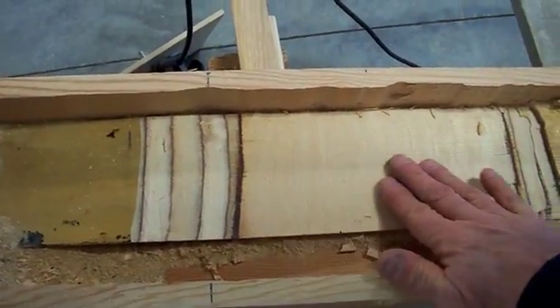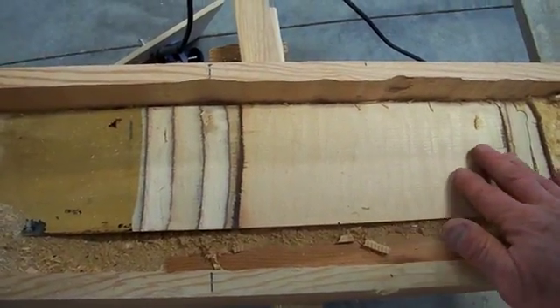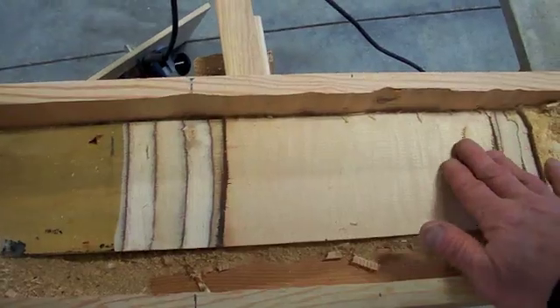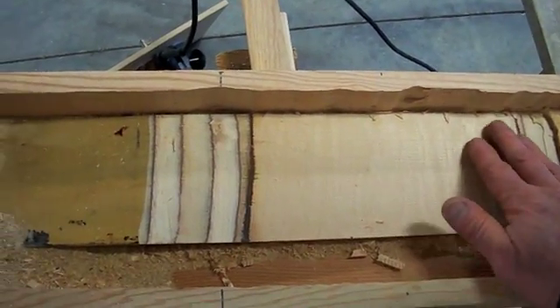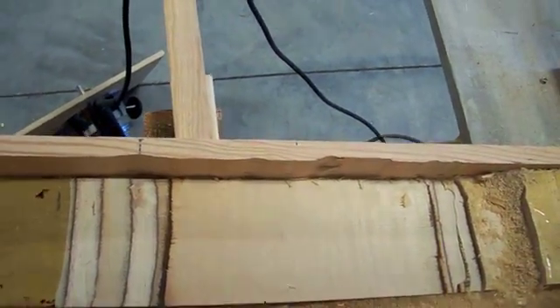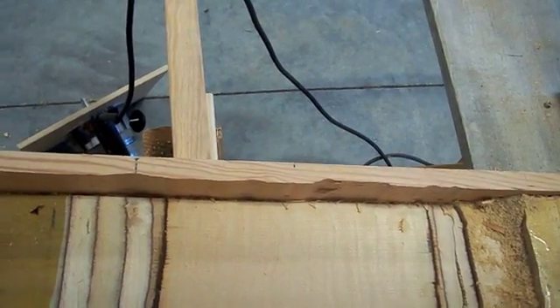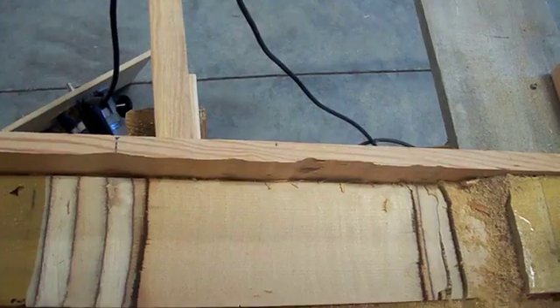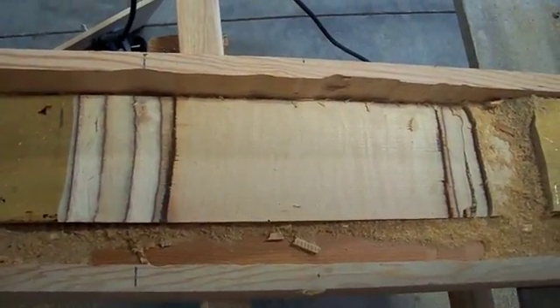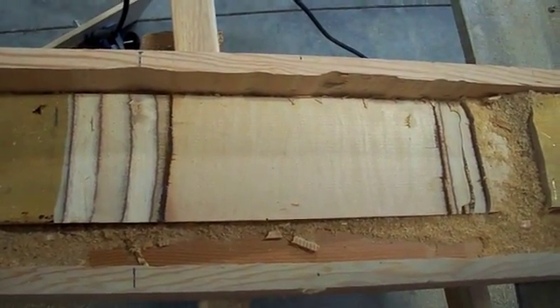It's pretty smooth. It's nice to cut with a mill end on the router because it opens up the pores in the wood and helps the glue to stick. You don't want to sand it — you want a nice cut so that when the boards glue together, there are little holes and crevices for the glue to jump into.